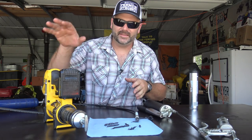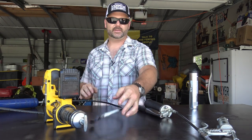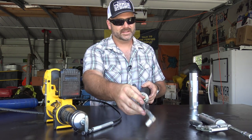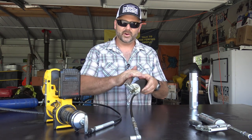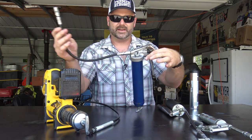The proof's in the pudding — this is the Mac Daddy for greasing your equipment. It depends on your budget. There is absolutely nothing wrong with any of these grease guns. The little guy is a bit on the cheesy side and much more work to pump. The large pump-handle one puts out a lot of grease — sometimes that's not exactly what you want because you don't want to pump twice and get grease all over everywhere. This one clearly puts out more per pump than any of the others aside from just holding the trigger on the DeWalt. My favorite manual gun — my go-to — pumps just the right amount of grease.